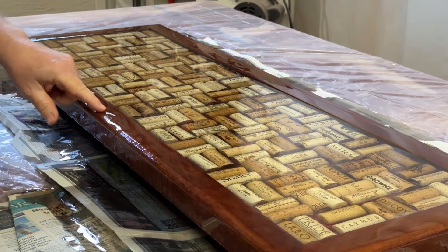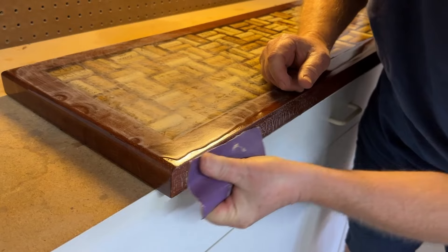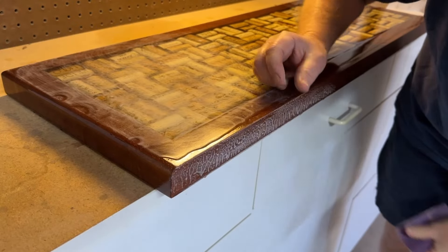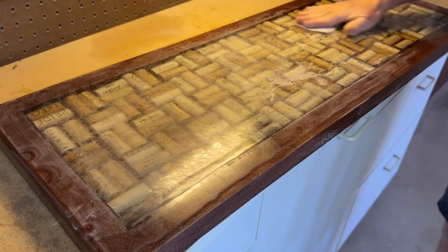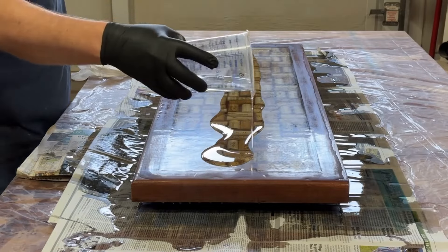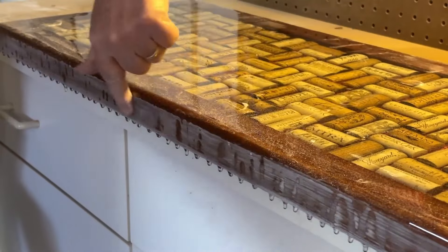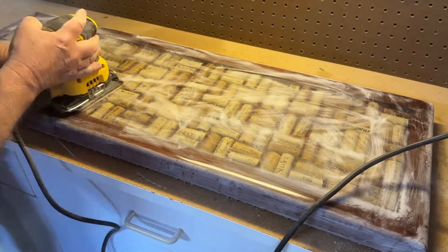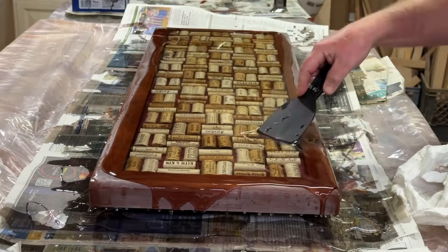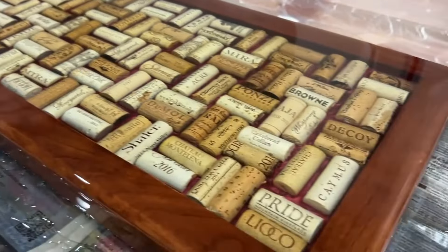The solution is to sand it down, then use the proper tabletop epoxy to finish it with. But I'm really concerned about sanding through to the wood, since the wood is stained and I don't want to nick the stain with the sandpaper. So what I did was sand a little bit — about as much as I thought I could do without exposing the wood — then put on a layer of tabletop epoxy, wait a couple of days for it to cure, then sand again and put on another layer. I did this three times over the course of a week and finally started to get a good result on the tabletop epoxy. I would say it never really got to the ultimate quality I would aspire to, and hopefully I'll get better on my next similar project.